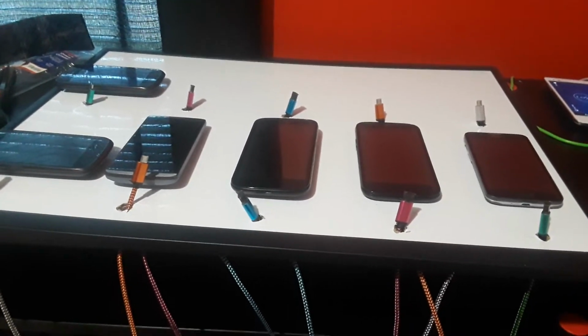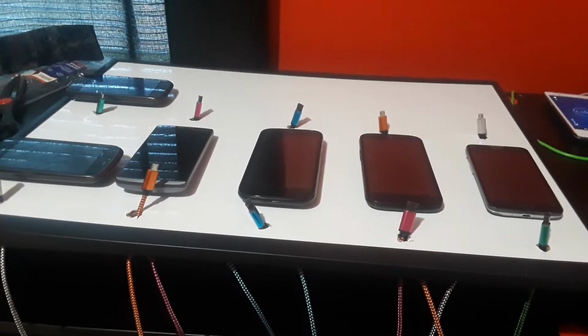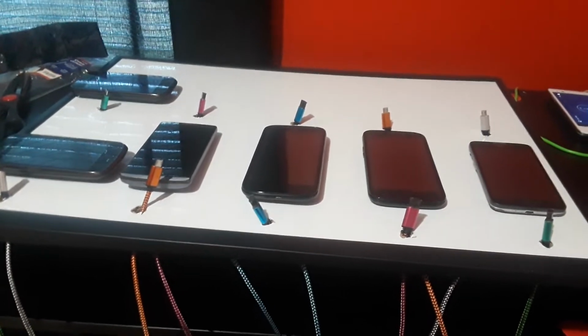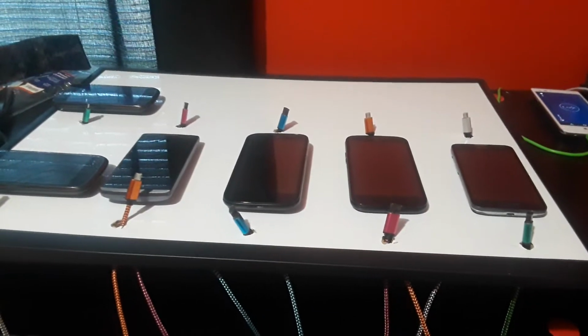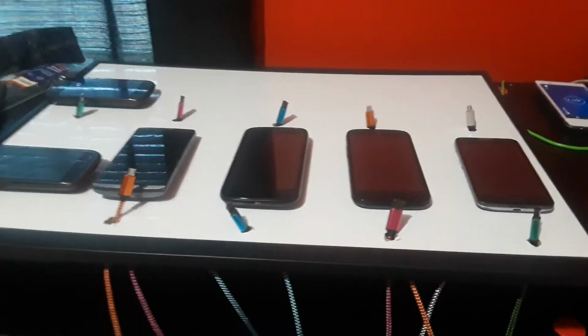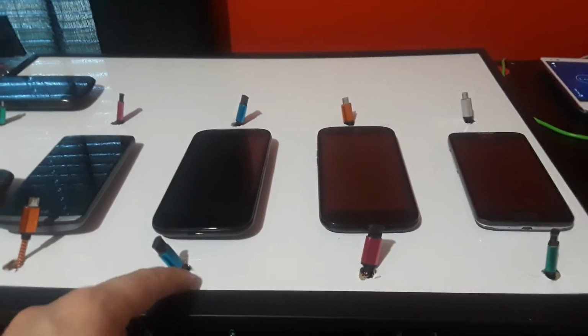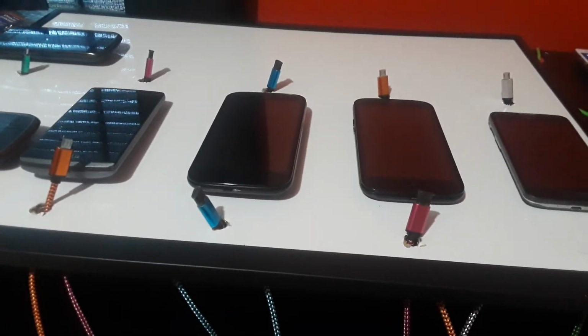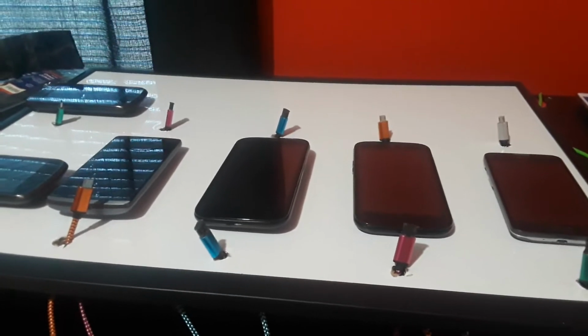Once again, do not buy a magnetic dry erase board. It will cause problems when drilling holes through there, and you're going to have to spend a lot of time trying to pull all the sharp metal that's going to spin off when you drill through it. Trust me, it's not worth it. For that reason, I'm going to have to put these little foam pads. I'll cut a little X in them and push them inside of those holes to make sure that none of that metal will fray our wires themselves. It will save you a lot of time and effort. Just don't get a magnetic one. I can't say that enough.